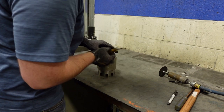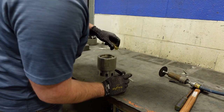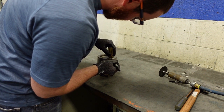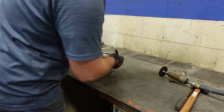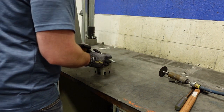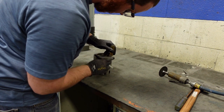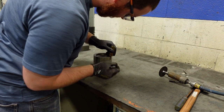You'll begin by using the small magnetic screwdriver to locate two magnets. Once you've located two magnets, use a marker to draw a straight line between them. Rotate the rotor assembly 180 degrees and repeat this process. You now have guidelines on both sides for cutting away and removing the sleeve.